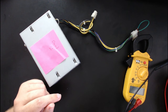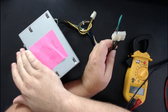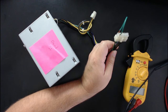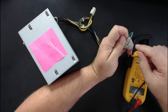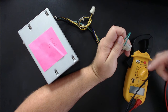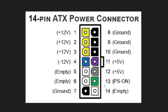I then removed the good power supply unit, plugged in the green wire jumper, and plugged the good power supply into the wall. The fan came on, indicating that power supply unit was good. Then I went ahead and tested the voltage of all the pins on this plug and made a little diagram — and did the same for the other plug while I was at it.